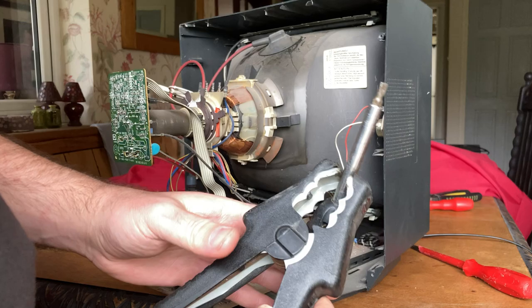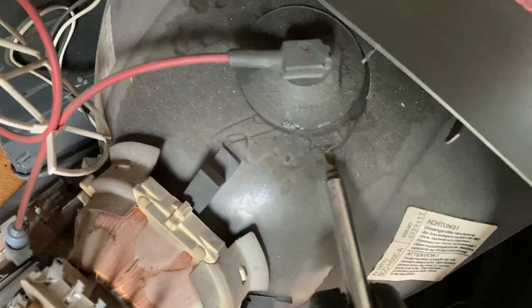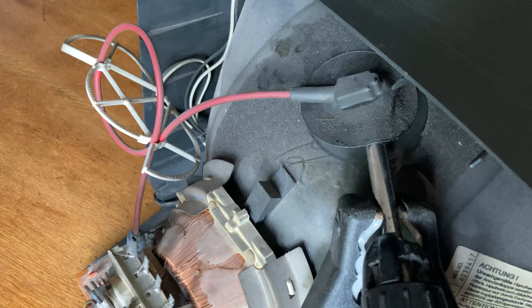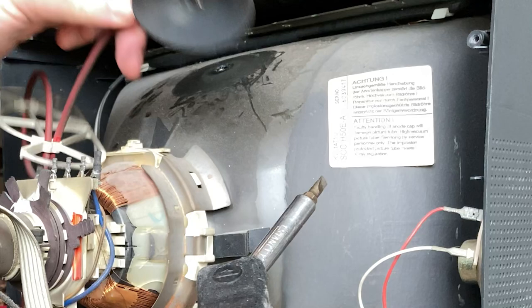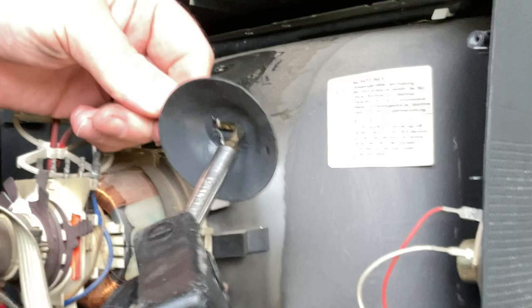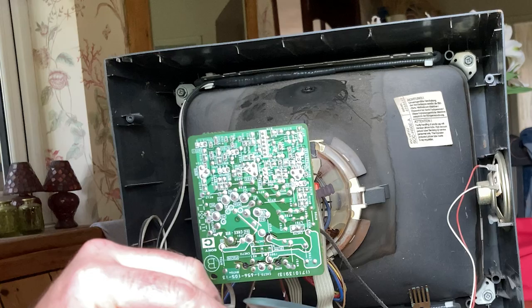There's background noise in the household so this is post-dubbed. The most important part with CRTs is earthing the anode itself. The anode is the main voltage running to the phosphor dots at the front of the screen — the phosphor screen is a positive charge, the cathode at the back is negative, and it's drawn to the front. It's not going to kill you but it won't be pleasant, so take a metal screwdriver with crocodile clips jumpered to a good earth — a nail in the ground or a chair leg touching the floor.